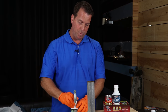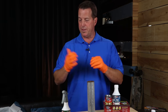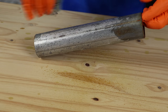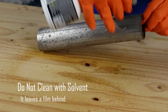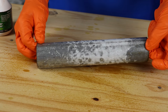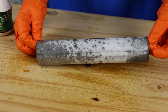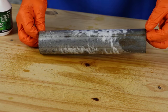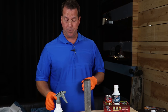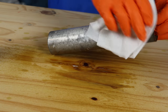Get a little squirt bottle. As you can see, I used different gloves. What you're going to do is saturate the pipe with the cleaner and let it sit for roughly five to ten minutes. After that, you're going to see that it gives kind of a white, residue-ish look to it. What that's doing is getting all of the oils, grease, and contaminants off the surface for the next step. You want to wash it with soap and water or just water as well, then dry it. Then we're going to go to step number two.